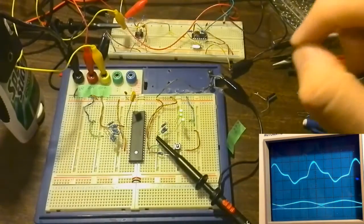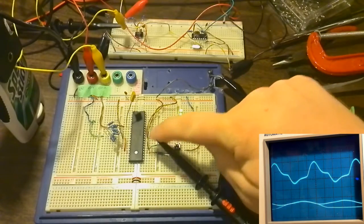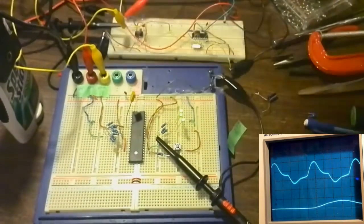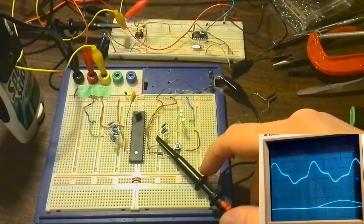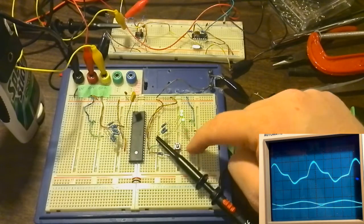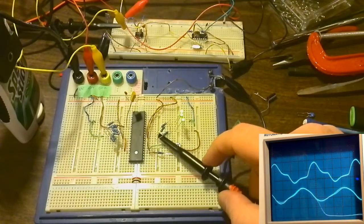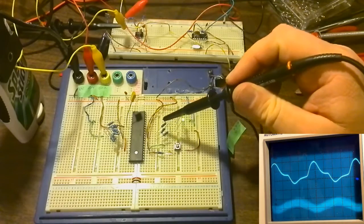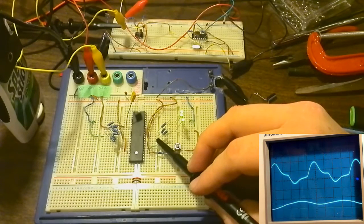The frequency on the input is 3.99 megahertz. The frequency I'm reading on A0 is 499 kilohertz. You've got to keep in mind this is like an internal fetch cycle — it's fetching the instruction which is hardwired here as NOP, and then basically just running through the addresses. These address lines will be descending multiples, so A0 is about 499 kilohertz, roughly 500 kilohertz.